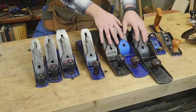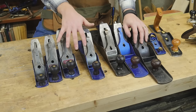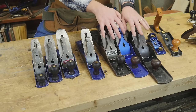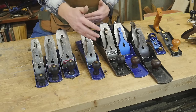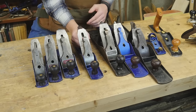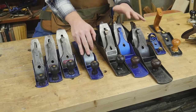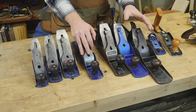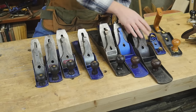After I've cleaned the wood, I'll come in with my jointer to actually take it down to flat. I'll try to get it flat with the heavier cutting plane, but I'll have a jointer set up with a moderate, fairly clean cut to make the board perfectly flat. I choose the jointing plane depending on board length: a number 5 works great up to about 3 feet; at 4 feet, you'll probably want a 6 or a 7; and anything over 4 feet, you'll probably want a number 8 — the plane that does long boards and makes them flat right off the plane.